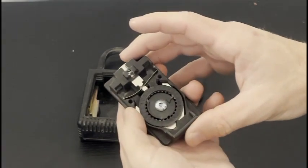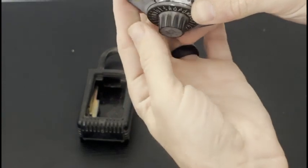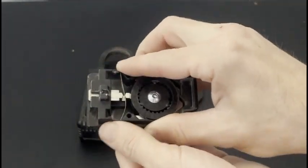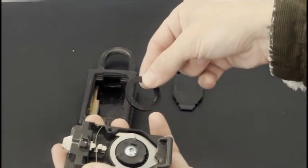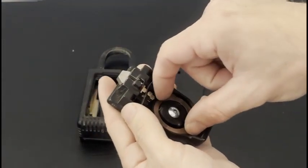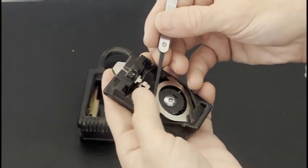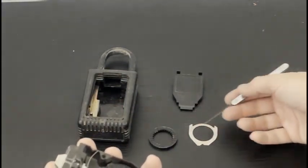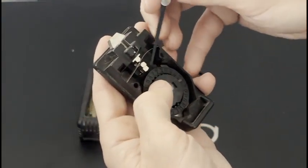You're going to have all of these wheels. First, make sure the switch goes upward so it's not in the way and not compressing the spring. Then take out the wheels — we'll remove wheel number one, set it aside, and take out this first plate. I'm going to use this pick just to help. You can put them next to each other in order so you don't get too confused.